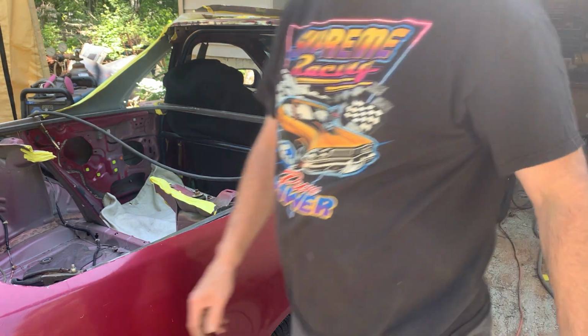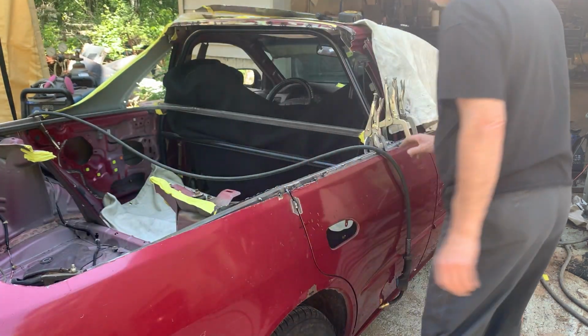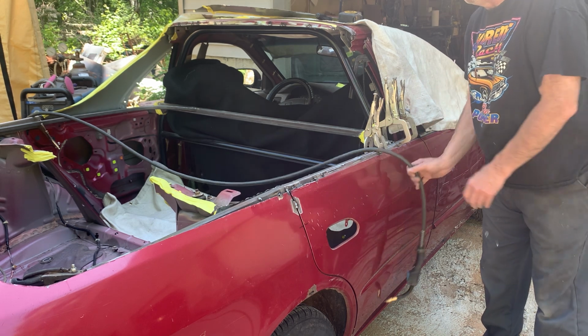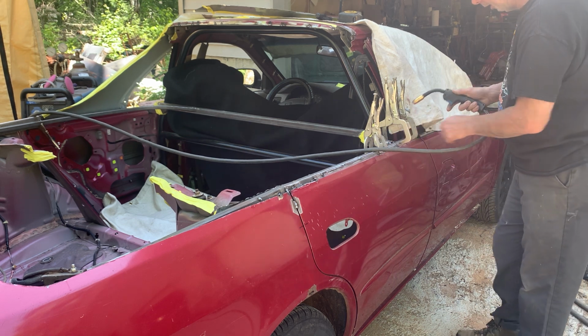Get a little more heat. Now when you're welding these panels, this is really thick. This isn't so thick, so you're welding it from here to there and bringing the bead over. I turn the heat up so it'll get good penetration onto here.